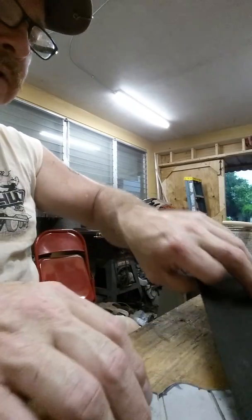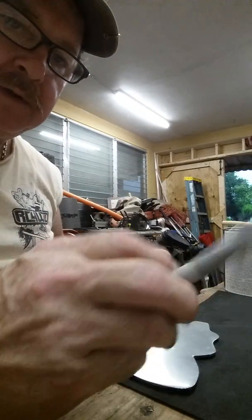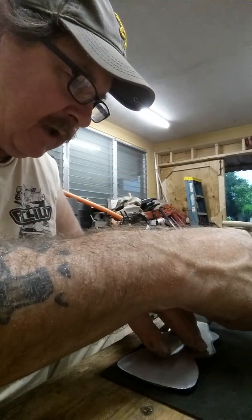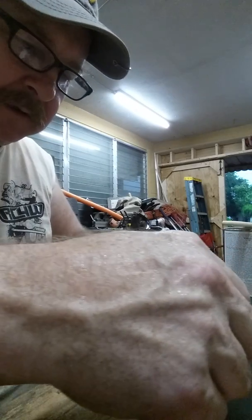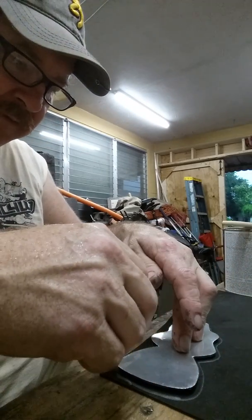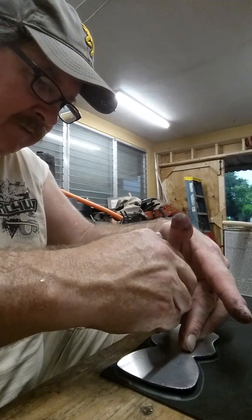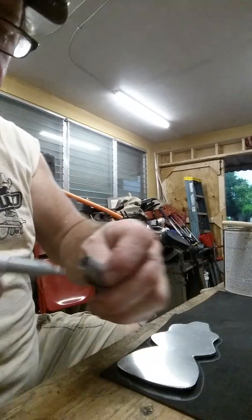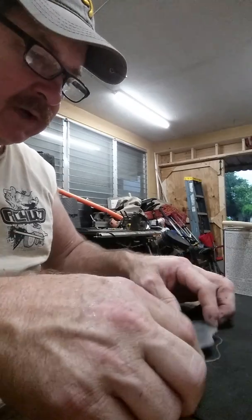So, alright, when it comes to putting the black vinyl surface on, what I've been doing is taking a silver Sharpie and going around what you have here, so I have an idea of where I'm going to put the contact cement on this black foam. I'm not going to cut this out because I'm going to be pushing it down and squishing it all over the place, and we want to make sure we have enough. If I were to cut it exact, it's probably not going to be the right size.